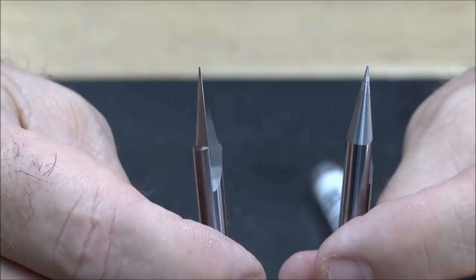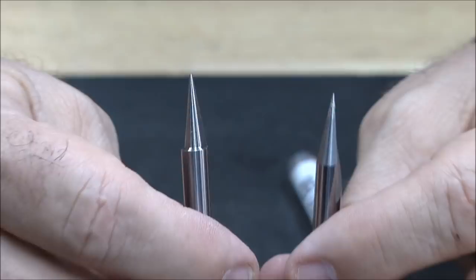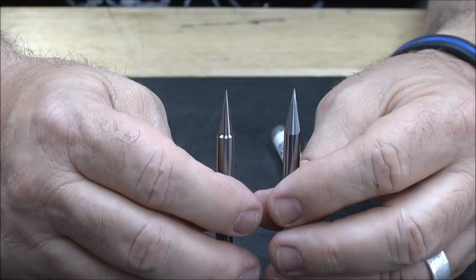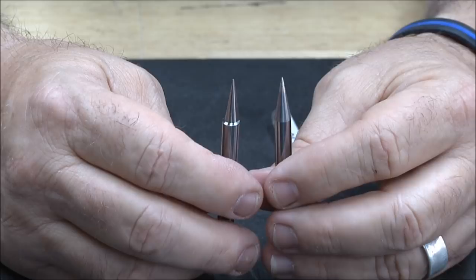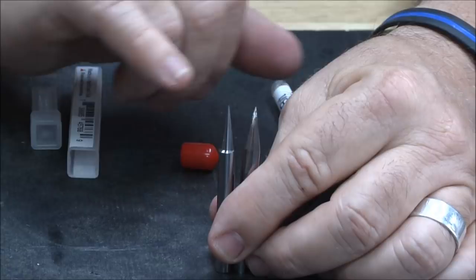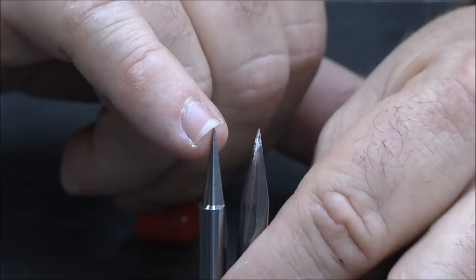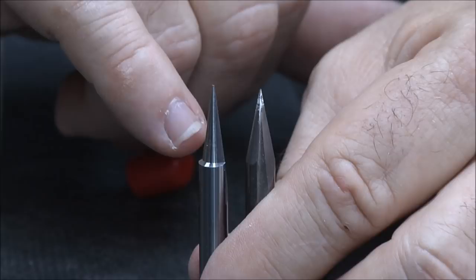The SC50 is 22 degrees and the Amana carving liner is 18 degrees. What that means is it cuts a skinnier line if you go deep enough. I've checked with Amana and their recommendation is not to go real deep with this bit, however I have cut pretty deep with it. Right at the tip it's got just a tiny bit of a flat, which I actually like — the chances of breaking it are even less because of that flat.